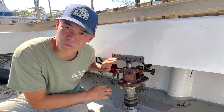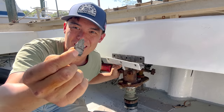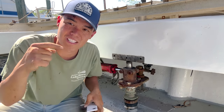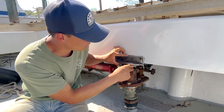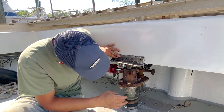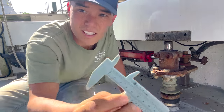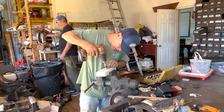I've got to make a new system to hold the top of this rudder — it's wobbling all over the place. This is what's regularly bolted here. Literally since I got this boat, the bushing for this is made out of a piece of PVC filleted down the center and put on either side and bolted up. The bushings just get cracked and worn out, and the wobbling has actually caused a crack on the hull. I think we're going to get a piece of angle iron bolted here and then have a piece of hard plastic like Delrin material on the back side and front side to hold the top of the shaft. I need to measure my shaft — I'm going to guess three inches. Yep, three inches.